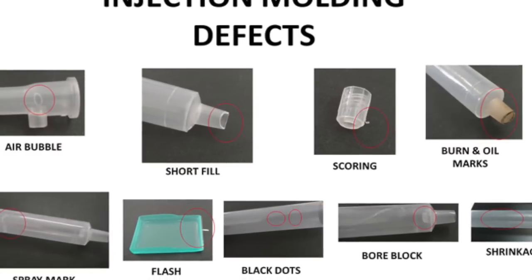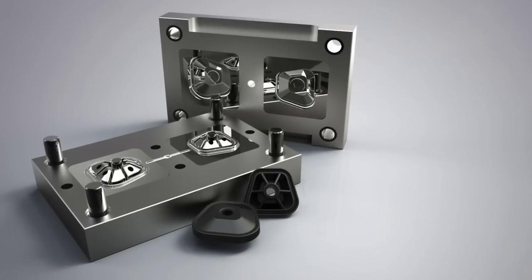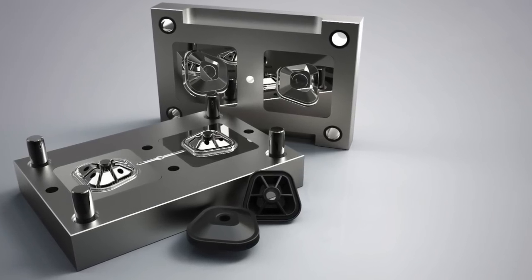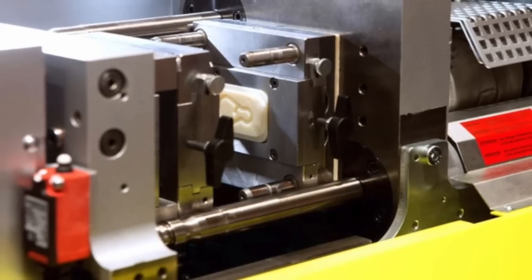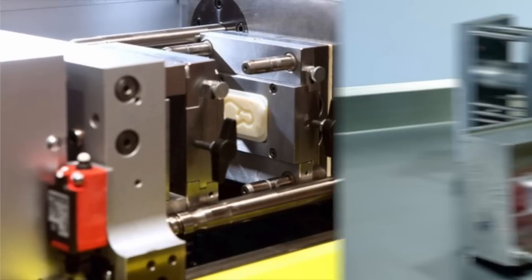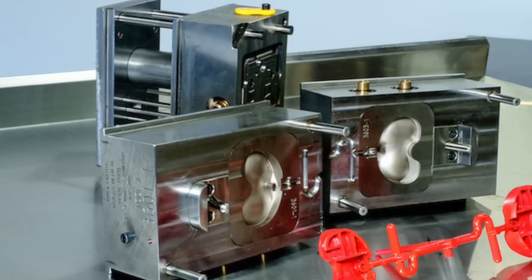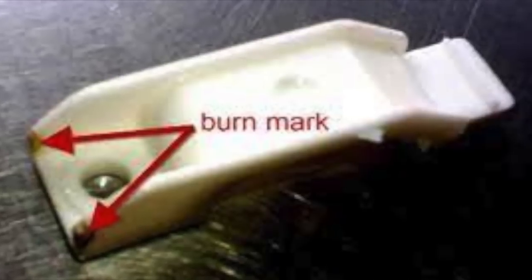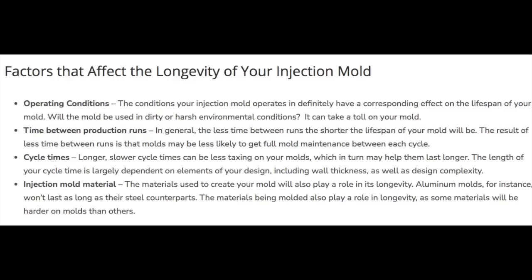When you're trying to avoid injection molding defects, you have to think about not only what material you're injecting into the mold, but what material you're making the mold out of — there are multiple different types. The different class of tooling you use has a direct correlation to how many times you can use that tool. When you're creating a large piece of metal with a specific shape carved into it, it obviously has to stand up to huge amounts of heat. There are five classes, coincidentally called Class 101 through 105, each with a specific number of uses.